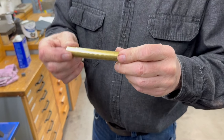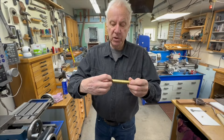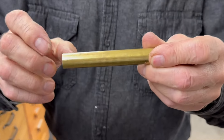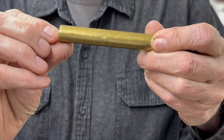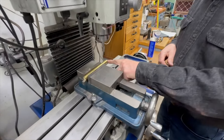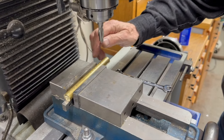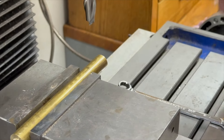This is 5/8" brass, and I'm going to mill in here a little over an inch — I want to make the bearing a half-inch wide — so I have a saw cut through there, and I'm going to mill exactly halfway down through this. This is 5/8" thick, so what I'm going to do is mill down 5/16", which is halfway through it, and just make it flat and a nice clean end there. The front is already faced off, so I have a nice smooth surface.